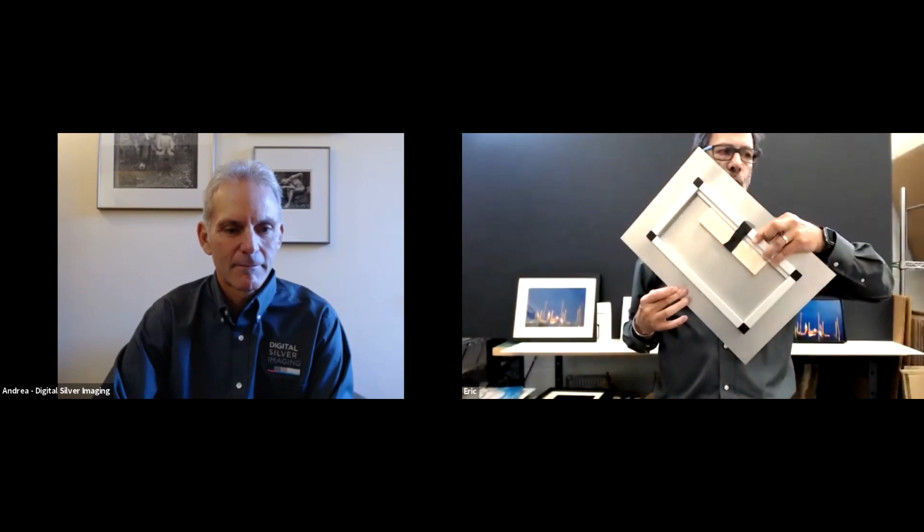This stuff is a double-sided adhesive, but we're using it to put our aluminum brackets on, like these, and we're going on to aluminum or Dibond. We use the VHB to stick this thing on here, and I will tell you, once this adheres, it can hold a fender onto a car. They use it in the sign industry outside to put up signs at construction sites. So it's the 3M product, stands for VHB.